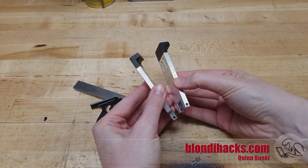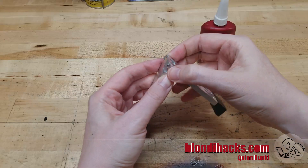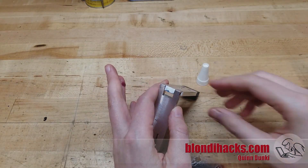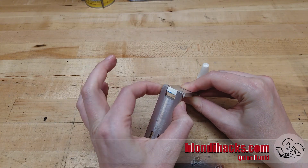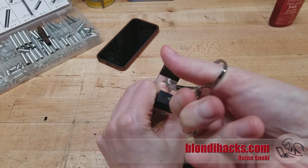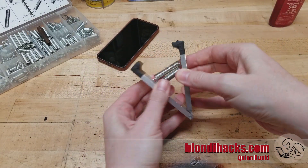There are my two parts. The hinge pin is assembled and a little bit of Loctite on one end just to hold it in place — don't get any in the hinge area itself. And I use some forceps to attach the springs.